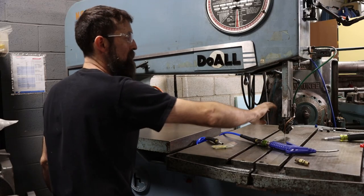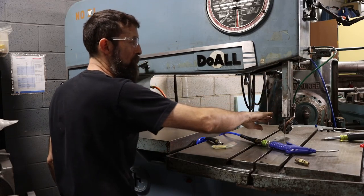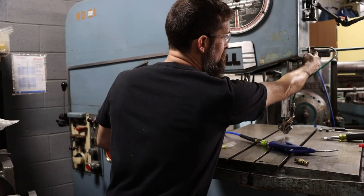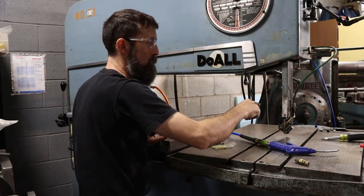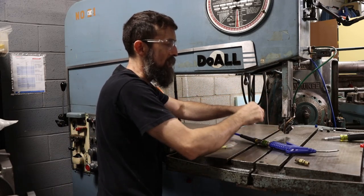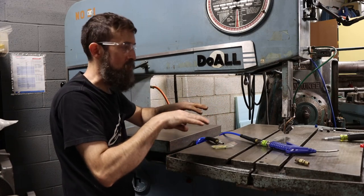That's good. Now we need to plumb that down to here. And although we don't want a lot of pressure, we want velocity. So we'll probably go from 1/4-inch to 1/8-inch. That's my thoughts anyway. Just a small 1/8-inch line. Speed that air up and blow those chips away.